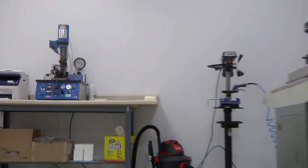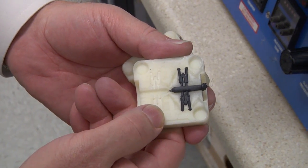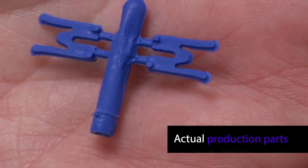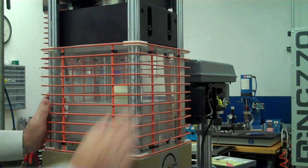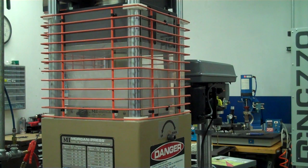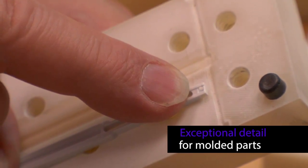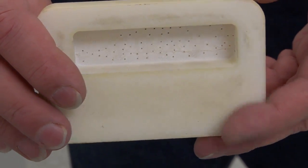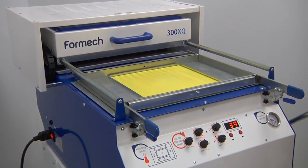Polycarbonate goes in around 550 degrees; we run LCPs injecting at about 635 to 640 degrees. We've seen no degradation in the molds at all — they just take the temperature. Some 3D-printed molds you see are running really low-temperature material with no real physical properties. Whereas these are actual production parts. A mold this large, when we put it in our Morgan press, we'll clamp it with 8 to 10 tons of pressure, no problem. You can see this tiny little feature here — that part of the mold was 3D printed.